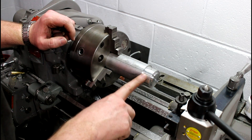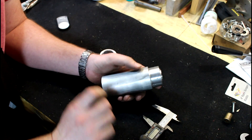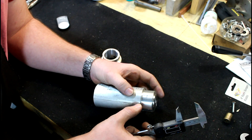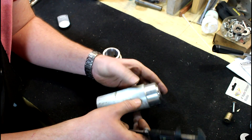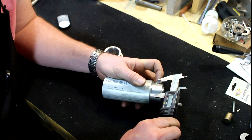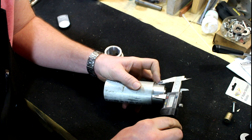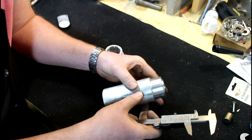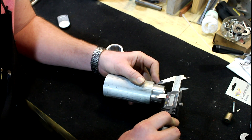Let's go to the bench and measure it with a pair of calipers and see how close we get. This isn't going to be very scientific, but it'll give us a good idea. I'll admit I made a few mistakes when I video recorded this and went back and edited it so what you just saw is correct. I got the 90-degree marks marked with a marker here. So measuring from mark to mark: 1.278, 1.279, 1.279 — and the last one is just a hair over, but it's damn close.